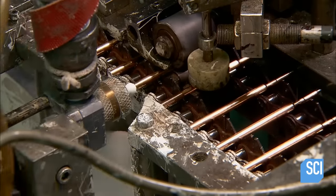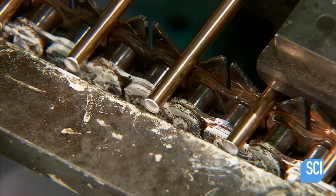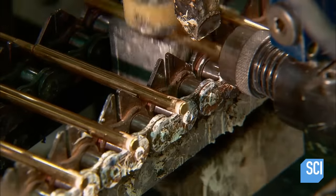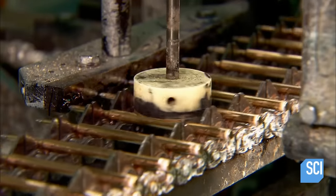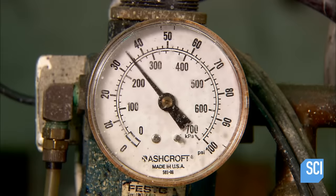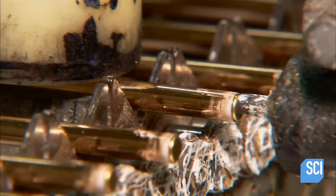Back to the other end of the tube, the machine applies a bit of sealant, injects nitrogen to pressurize the refill, then caps the tube with a hollow brass plug. Nitrogen is ideal for pressurizing because it's an inert gas that doesn't harm the refill tube or its contents.